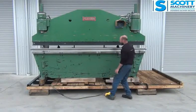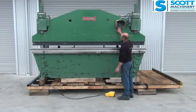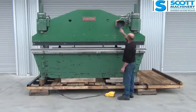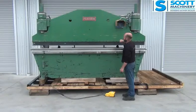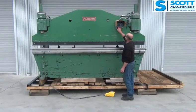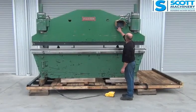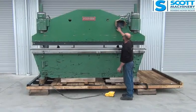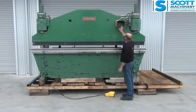So the back gauge you may be able to see or not. It's in manual at the moment, and it's on number 1. So there's the back gauge fully back, and then it's coming forward onto 499.96. If I push go again on the manual, it goes to its second setting, which is 290 millimetres. Push go again, number 3, which is 225. Go again, number 4, 222. Number 5 is 184, and each time that back gauge is moving to its position. Number 6, which is 500, and so it's got 6 stored memories there, so we're back to number 1.